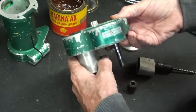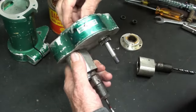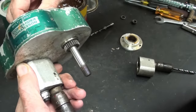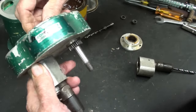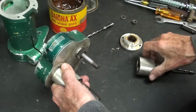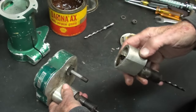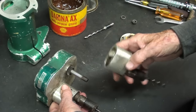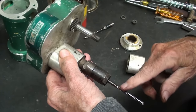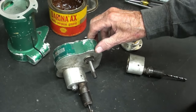I seated the big gear into the bearing. When we turn this clockwise, this gear is going counter-clockwise. So since we want this drill to go clockwise, when this other spindle is put on with yet one more gear, that reverses the direction. So in the final event, both of these drills will be turning clockwise.